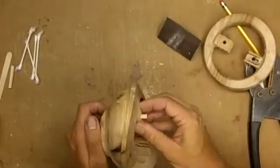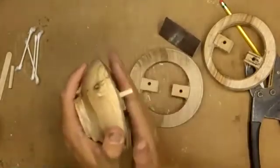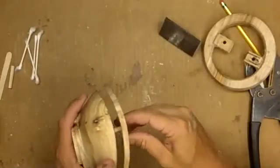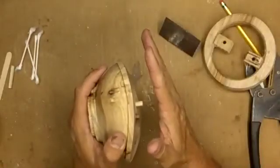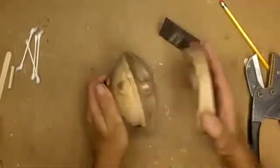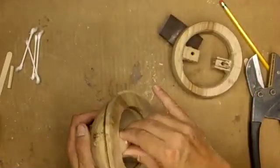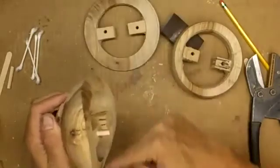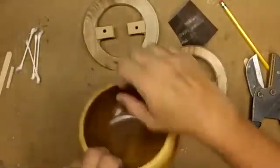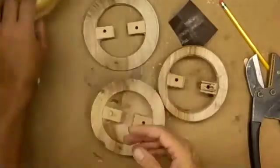you take it before you glue it up, and you've got it in pieces here. You glue the veneer onto this surface here. So I'll put a little veneer that's cut slightly proud, stack it back onto the lathe with all the parts, clamp it, and then I'll do the same thing on the top. Put the veneer on the top, stack it all back on the lathe, clamp it all together that way, and then we just take the ring out, trim the veneer, smooth it as we can, blend it in, and then when we glue the whole piece, that veneer will show up in the gap of the glue joint, and it'll give you a nice little accented design on the inside.